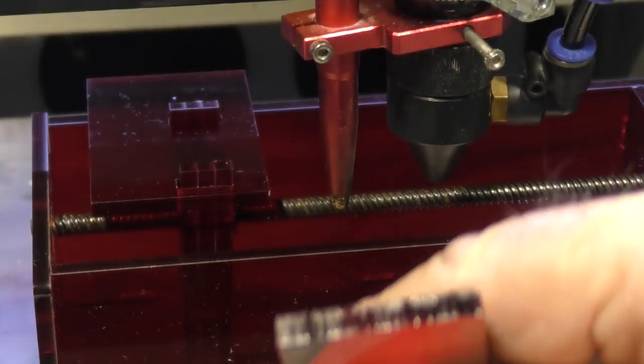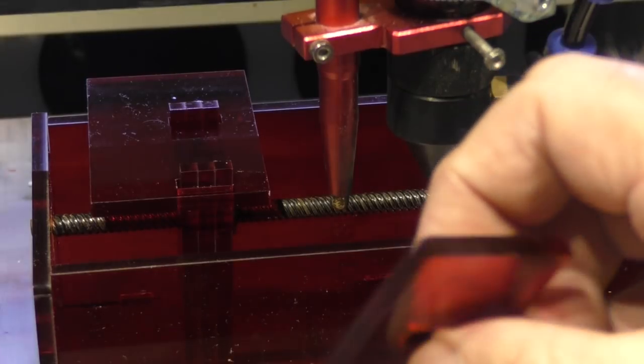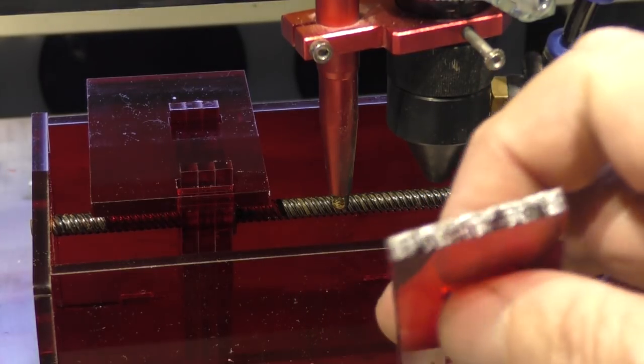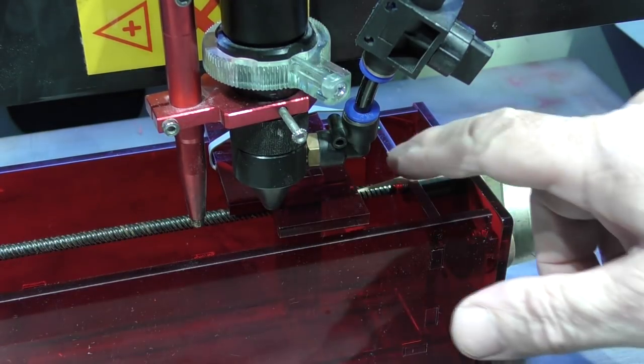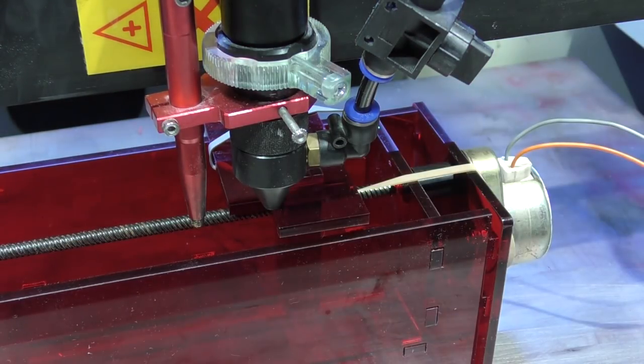That's the cut it produced - the normal machine cut with air assist. And this was the machine cut without air assist. We've got exactly the same sort of striations on there. I've put an elastic band around to keep all the backlash one way. I know this is a bit of a bodge job but it only has to work a few times to prove the point. We need constant smooth motion, and now we're absolutely certain we've got it with the backlash restraint on.